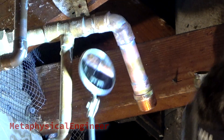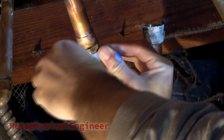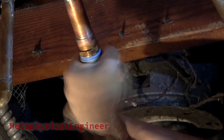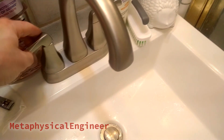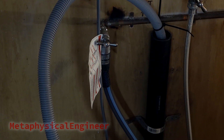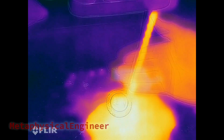Joint visual inspection is a pass. Use fresh Teflon tape for the threads any time a joint requiring such is disassembled. Wrap it in the same direction as threads tighten, so the loose end is not caught and peeled away by the tightening action. Start threads and run down by hand before final tighten with wrenches. Use a backing wrench to avoid stressing the pipe. Closing the drain valve and the bathroom faucet, open the main valve just a fraction to let pressure build slowly and limit the geyser had I made a grave error. Once lines reach full pressure without leaks, carefully opening the washer valve again purges some of the air and flushes the inside of the new joints. Finally, you can open the main valve all the way and enjoy leak-free hot water. Problem solved, and here's to 2024.